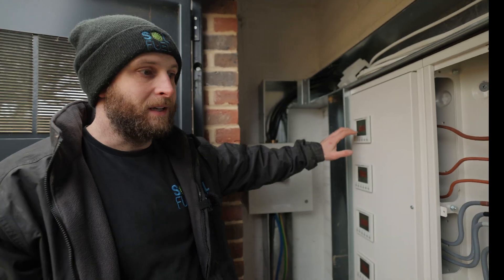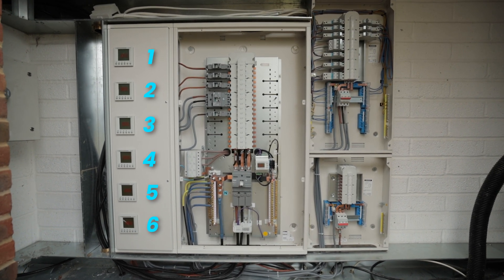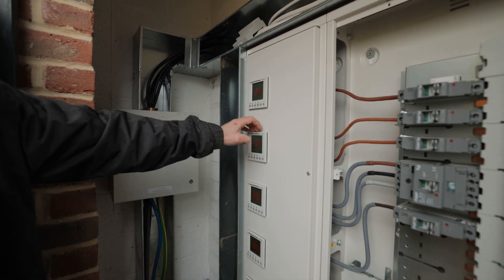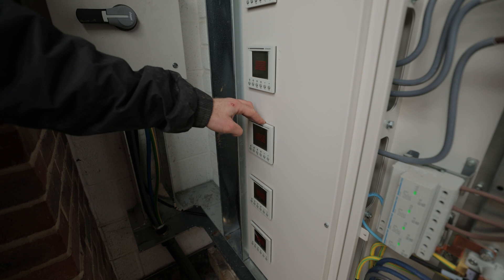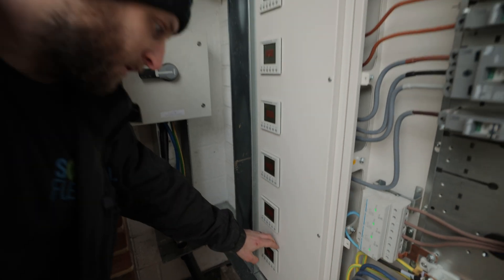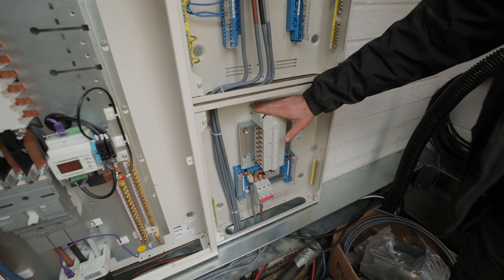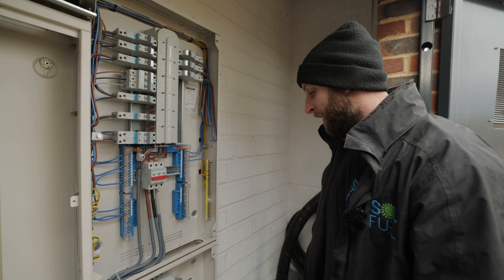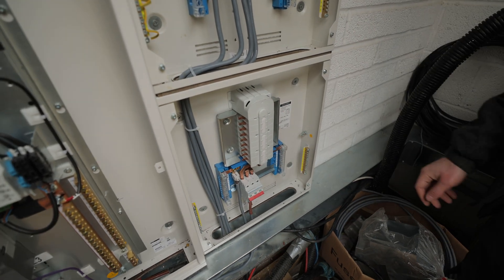We've also got on this property a meter for each consumer unit, just so we know where the power is being used most. We've got a meter monitoring the top floor consumer unit, one for the first floor, and one for the ground floor. There's a meter for our mechanical board monitoring the heat pumps and air conditioning units. We've got this meter here that's going to be for a solar consumer unit in the future, and another one for a potential swimming pool building. So we've prepped this solar consumer unit now whilst doing all the other work — it will house a couple of solar arrays and some battery storage, so we've got plenty of room in there.